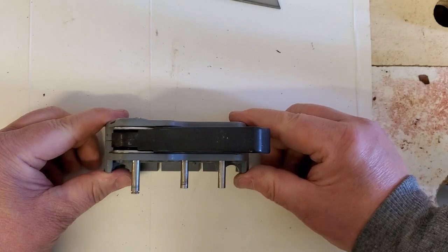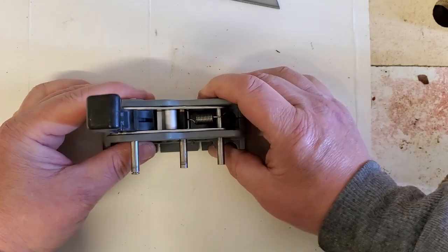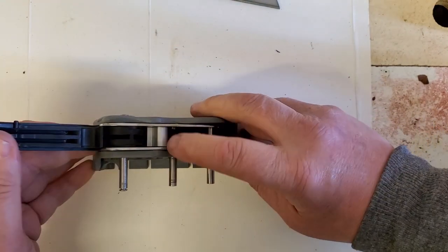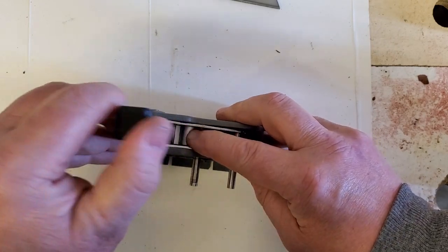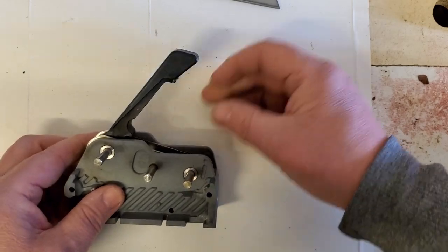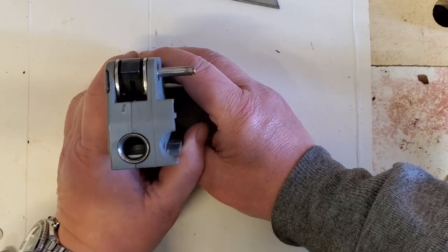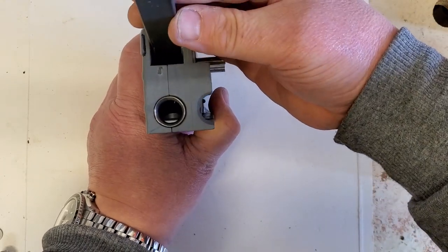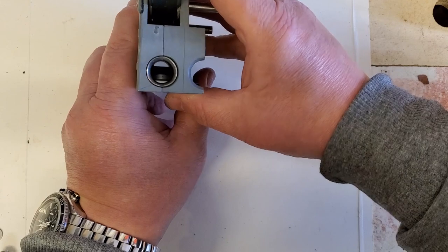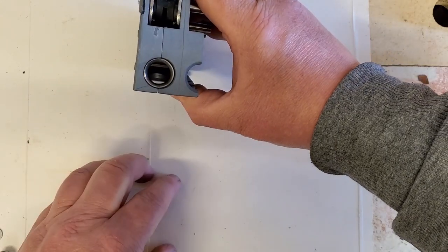Once you've got one side and the middle together, you should have three pins sticking out. You should be able to move the handle up and down smoothly, and when you reach the far end of your motion you should see this cam going up and down with the stainless steel plates going up and down. You can see the stainless steel plates going up and down, and on the inside when it's fully open you should be able to see all the way through. Once the jamming cam is all the way down, you can't see all the way through.